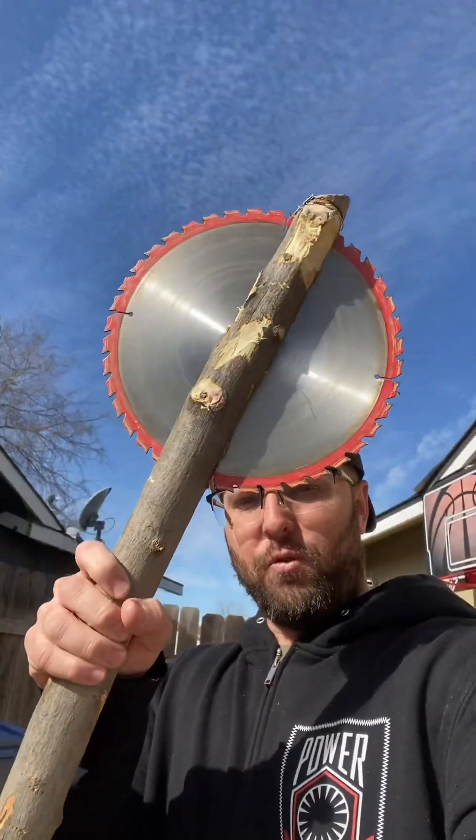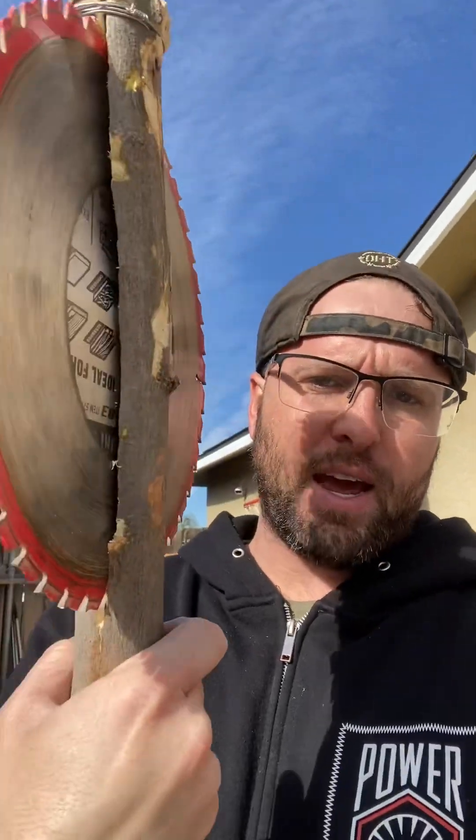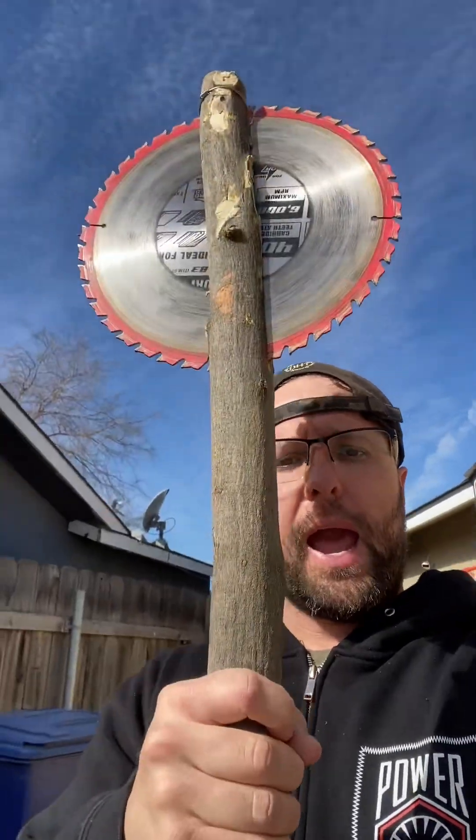Welcome back. As you can see, this part of the blade is done. The peg is now cleaned off, and the top safety wire is still holding. If you do not have a file, your blade is finished as-is — it won't be great for chopping wood or kindling, but it is still effective as a weapon for protection against animals or adversaries. If you do have a way of sharpening it, we're going to hand file it and shorten the handle a bit, since at this length it requires two hands like a normal axe.